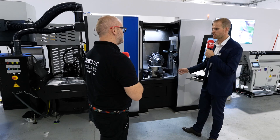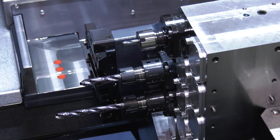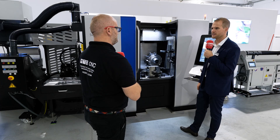On the counter operation block, you have four fixed tools for turning, four rotating tools, up to eight fixed tools for drilling or tapping, and up to four cross-live tools on the side.